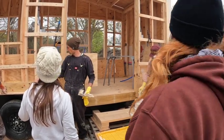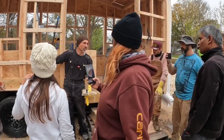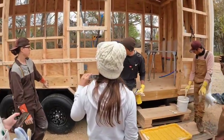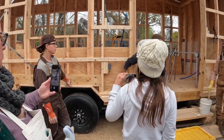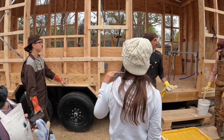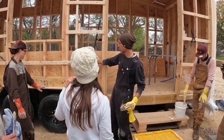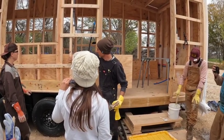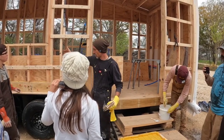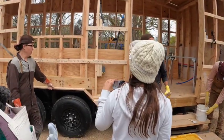So what we like to do is get a nice soupy lime mix, and then we just get a little slap happy. We need to be careful around the boxes. We really don't want to have lime sitting in our electrical boxes. Obviously when we get in there, you don't need to paint this. Do not paint the plywood generally, because we want to take it off, and I don't want it to bind to the plywood. So we really want to focus on everything that's going to be staying in the wall. So you get it on here, you can get it on the face. Don't need to get it on the inside face because there's nothing going to bind to that. This we're going to take off, so we don't need any binder on this piece.